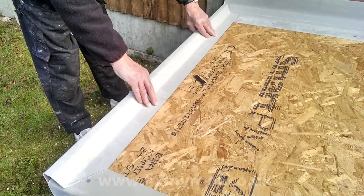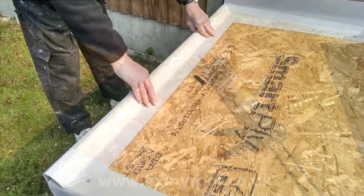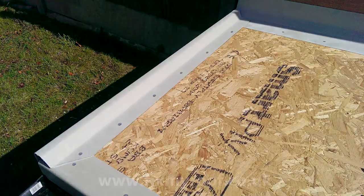As an alternative to just nailing, I'm going to stick this trim into place with PU adhesive or fix-all. Mark a line on the roof deck so that you know the position of the trim when you remove it. Apply a few dobs of PU adhesive about every 300 millimeters wherever the flange of the trim touches the surface of the decking. Rub the trim firmly into place before fixing it finally with nails. To be honest, I hardly ever bother applying PU to the decking unless I'm working single-handed, in which case it's very useful for holding the trims into place before making the final fixing.